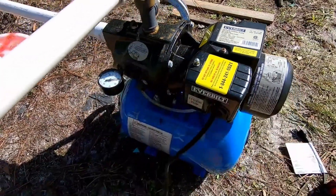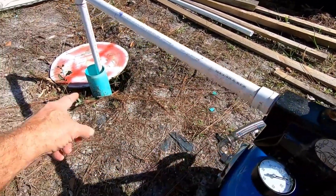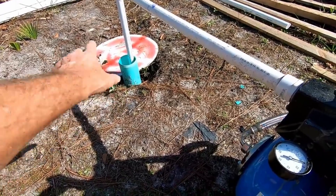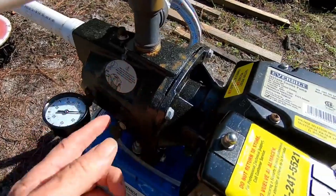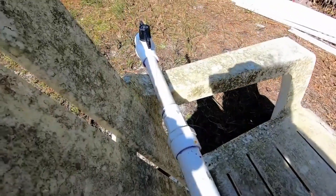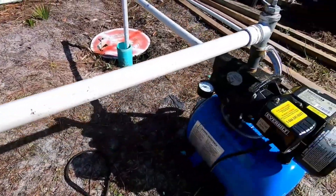Just a real quick review. We've got our inlet, the suction line, coming out of the well — we just watched that video of how much work that was to put together. We'll bring up a one-inch pipe that comes up and goes into the pump. The pump's just going to pull that water right out through here. I added a little valve just to keep it — I can show you real quick. What a great little system to run — it works so good.